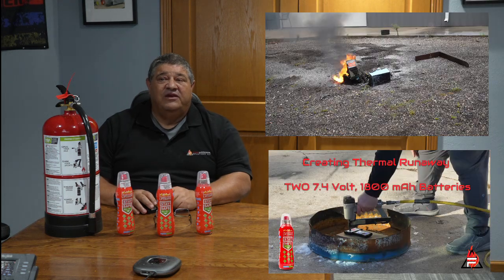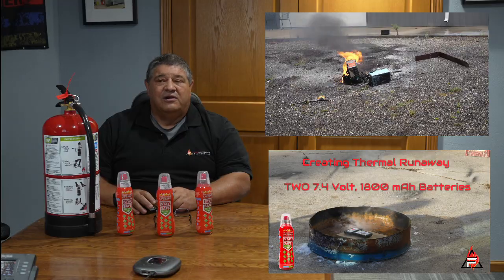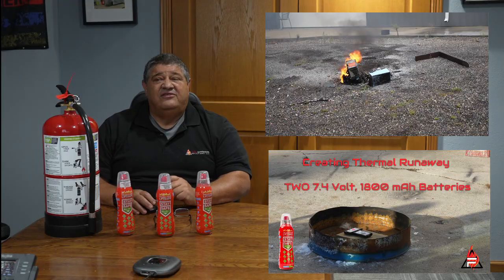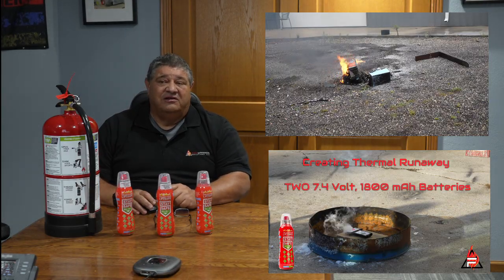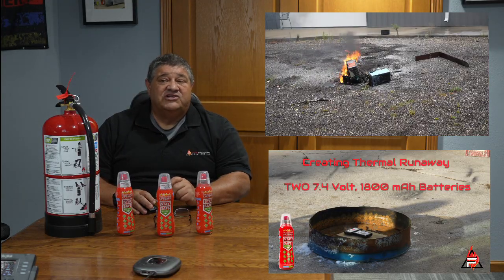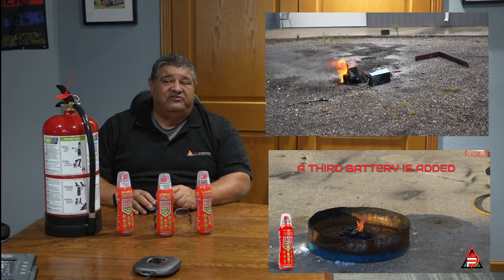In the next videos, you'll see me damaging a battery in the lower. That smoke coming off is not smoke — that's hydrogen fluoride gas. That is extremely dangerous and will give us thermal burns in our lungs. At 110 degrees Celsius, those batteries will go from off-gassing to ignition. And if we watch in the upper right-hand corner, you'll see it producing its own oxygen.